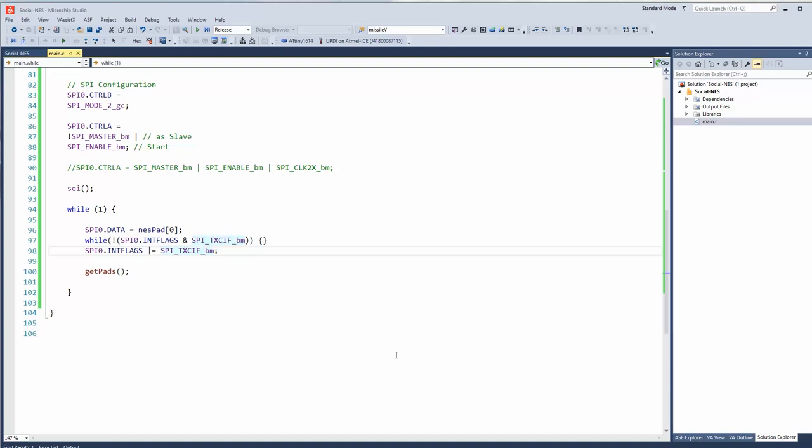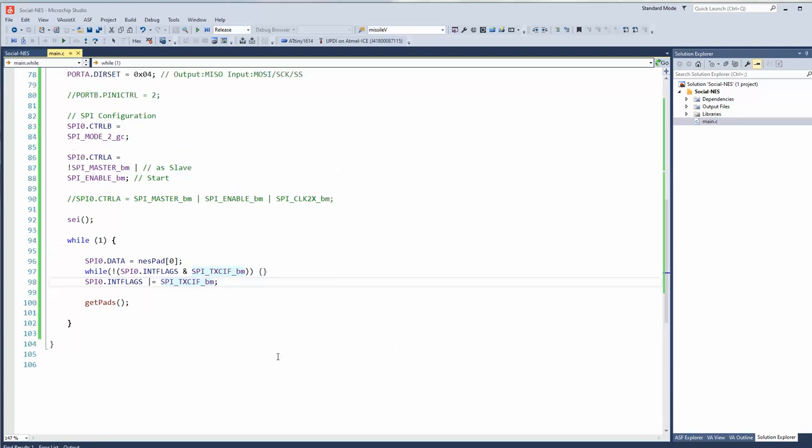Because, you know, there's a shift register on the controller, but the Nintendo is, for all intents and purposes, bit-banging out the data. It's using a special register on the CPU, but it's still being bit-banged by software. If I do it with interrupts, I could make the timing exactly what the Nintendo expects. It works in the main screen, like moving the menu around for the Retro USB, but I know it has a much higher frequency than a Nintendo, which means it's probably sampling the edges sooner and getting valid data, whereas a Nintendo is too slow.